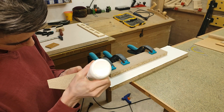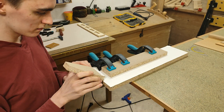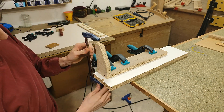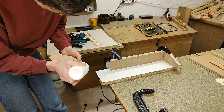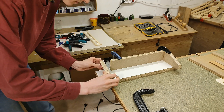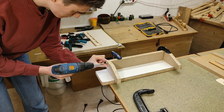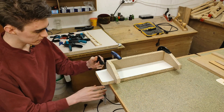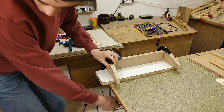The particle board: I'm going to glue and screw these pieces together — screws not for stability, but mainly for the clamping action, since I don't have appropriately sized clamps. The other side needs to be done face-down on a flat surface to ensure the front edges of the two braces are indeed parallel; otherwise it'll twist the X-axis once I screw it on, compromising accuracy.